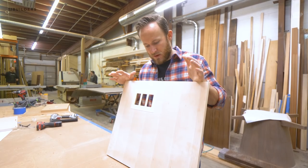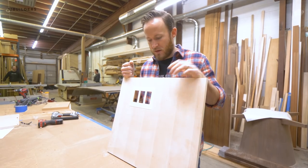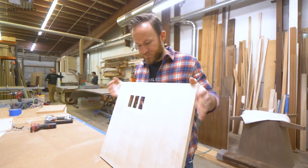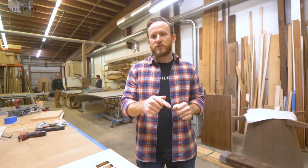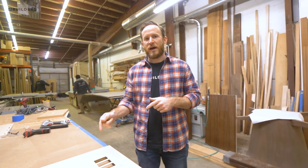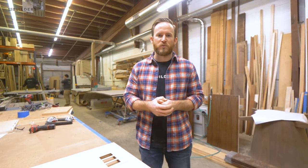Another great consideration on how to make a triple-gang look a lot better in the side of a cabinet — you can imagine if it were protruding out it would look pretty standard, but flush just looks a lot nicer. This is something we decided on our own — the architect spec'd the three-gang switch on the side and we just decided to make it flush. That's kind of our standard. Appreciate you guys following along with these site visits on a weekly basis. Stay tuned for tomorrow's Revealed — we're going to walk through all the equipment here in the shop. Make sure you subscribe to our YouTube channel and turn on notifications, and we'll see you guys next week.